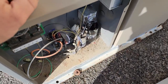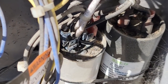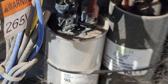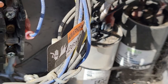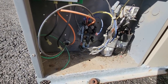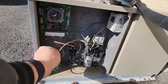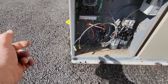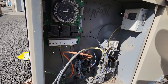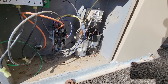The sun's making it easier to see what's going on out here. It looks like we've got a capacitor that's a little smoked. The contactor is pulled in but the unit's not running. The defrost clock out here looks unhooked — they're doing defrost from the inside. Let's see if the capacitor is the issue.